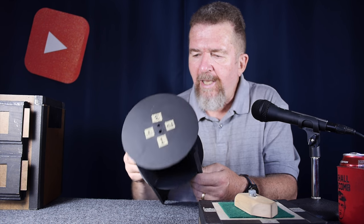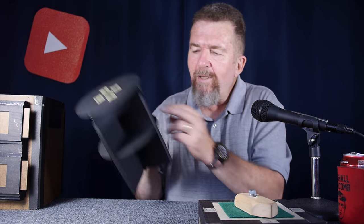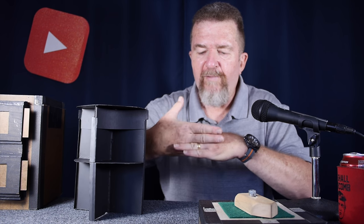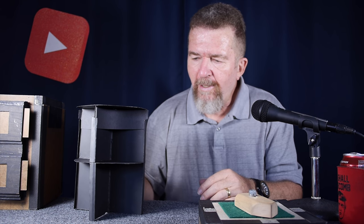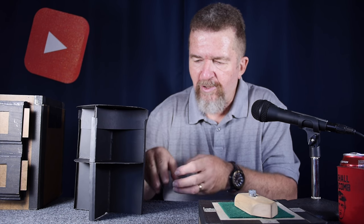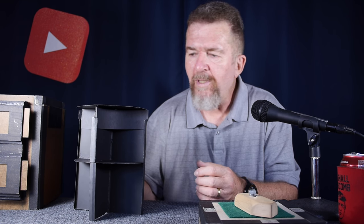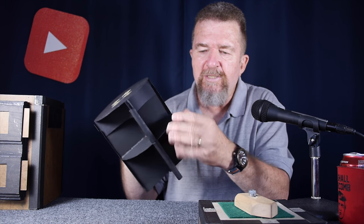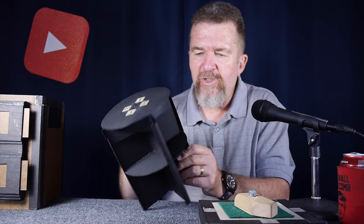You can buy galvanized steel in big sheets and cut it with a heavy-duty guillotine-style paper trimmer or metal shears. The great thing about galvanized steel is you can solder it together. Each tier of the carousel is built of two intersecting vanes to make four quadrants - they're slotted so they fit into each other. I wire-brushed the surface with a drill attachment, then used a propane torch with liquid solder flux and rosin core solder to solder them together. The discs were also wire-brushed and soldered the same way.